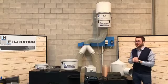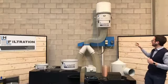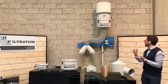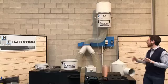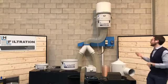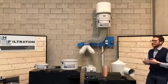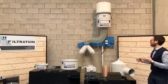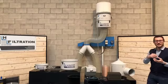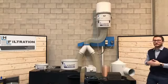accumulated on that part. On that point, it's extremely important that you use a pipe which is not rough inside. Sorry, I don't remember the English word, but it's a spiral one with a smooth inside, so that you don't have the oil accumulated on that pipe. This is extremely important, because you can have a lower performance of the filter, but you can also have bad smells when all the oil gets stuck in the flexible pipe. So yes, you should take care also of these kind of things, of course.